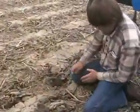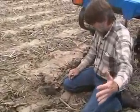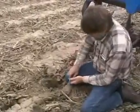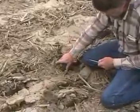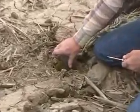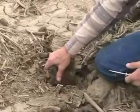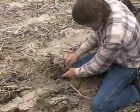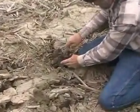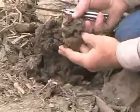Looking from the opposite side of the machine now, we're looking in from the center line of the tool toward the compression thrust side of the tine. This is the actual result in this fairly elastic plastic clay loam soil of northwestern Ohio. This soil has been lifted because it just tends to adhere to the tine given the moisture conditions today. But even though it's been lifted and worked, you'll see there's an amount of fracture in here.